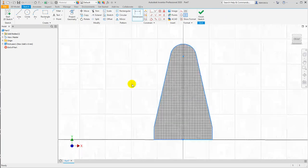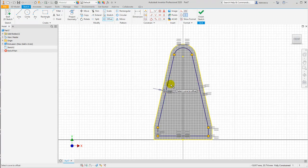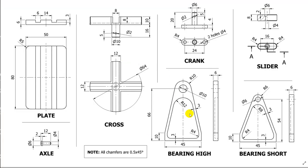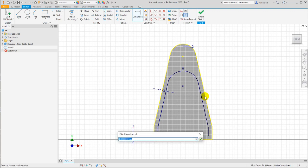And here we create a pocket by using offset of three, but with another radius here. I'll eliminate this to put radius of 12. So fillet 12 between this and this. The problem is that we have to add the dimension here because it was broken — the offset was broken. Now it is constrained as you can see here. Finish sketch.